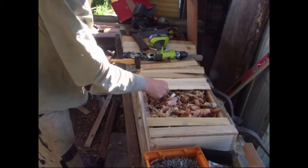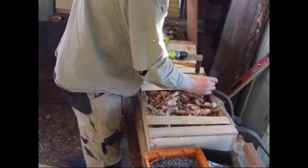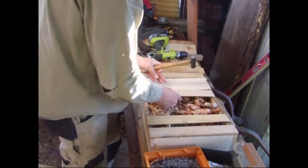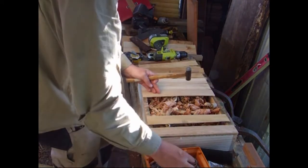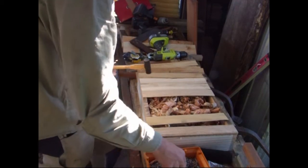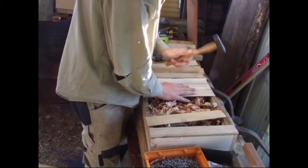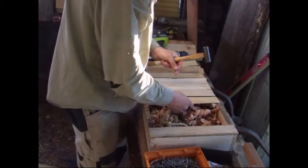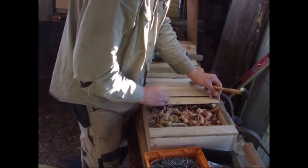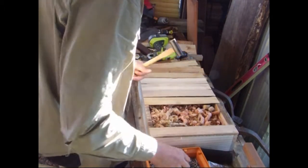Because at the moment these are dry. I've got these from a guy I know who's got a factory — these are kiln-dried, they've been in the factory's warehouse going to their scrap bin. So they're basically as shrunk as they're going to shrink, and as soon as they get a bit of moisture they're going to expand. Now you've seen me use Californian redwood — this is the Californian redwood. It doesn't move or shrink much, it's only about 4%. Pine can be as much as 10%. These big flats are actually oak, believe it or not.